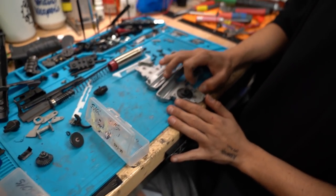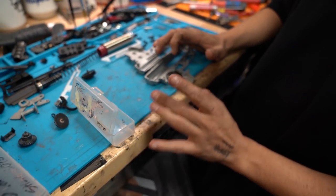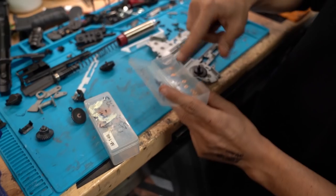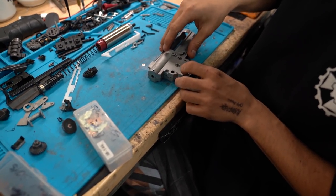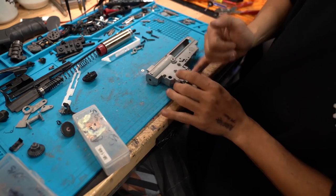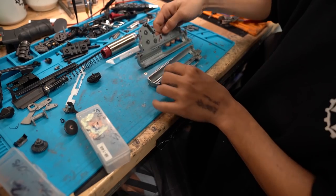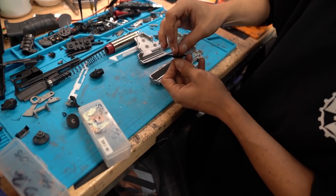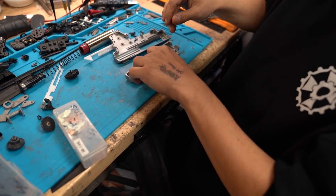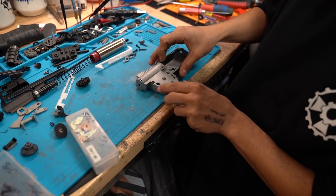So if you think about each gear by itself, you want to think about it like this. You're spinning it, and you see there's still, this is where I start, spur down, it's still spinning a little bit. I can hear that there's something it's running into. Obviously this is not the best test bed, because I can get rid of that by doing this and spinning it, because then the axis of it is corrected. Still making noise, not good. Now I'm at 0.3 on bottom, and this is usually where I'm at most of the time. 0.3 is always going to give me a really decent sounding situation.